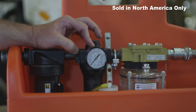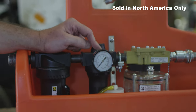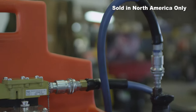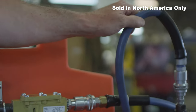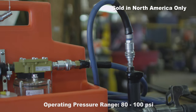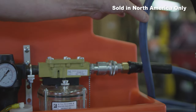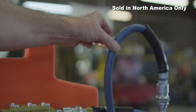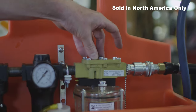The regulator is preset to reduce your shop air to 102 PSI. Once the air passes into the single point lubricator and the 25 foot blue hose, you will get a 12 to 15 PSI drop in pressure, meaning it will be about 90 PSI at the end of the hose where the tool is — the perfect range for the tool. The specialty blue hose has a small capillary tube running down the middle that is pre-filled with oil. Unlike mist lubricators which simply spray oil into the hose, the single point lubricator is preset to inject a half a drop of oil every fifth pull of the trigger on the Blue Torque.